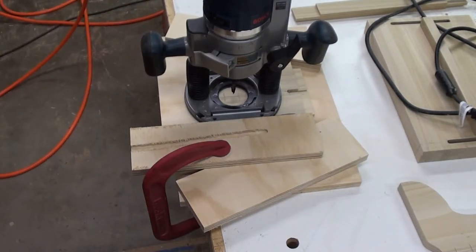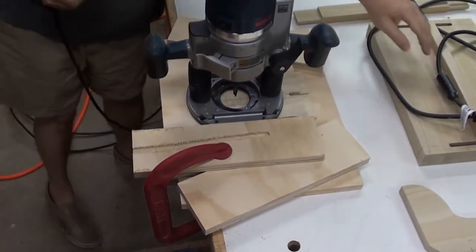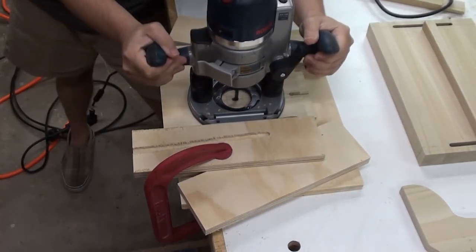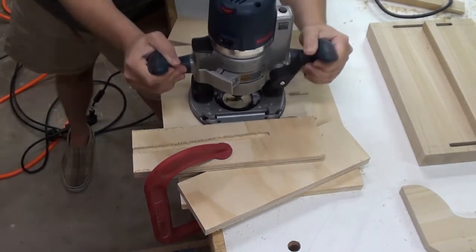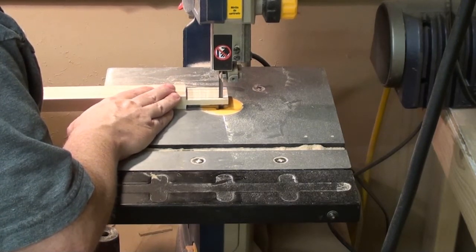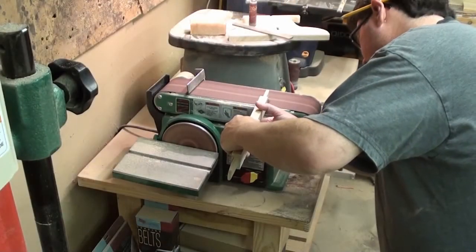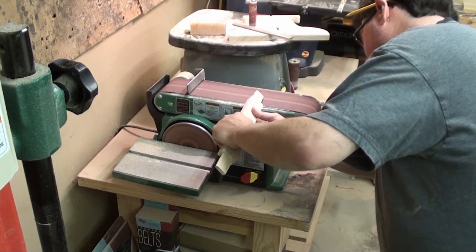Shooting from the hip, I decided halfway through the project to make the bottom cross beam a through mortise and pin it, so here's my contraption to try to make that cut. Just finishing up that tenon on that lower cross beam. Now we're going to round over those tenons so it can fit through that through mortise.